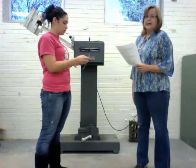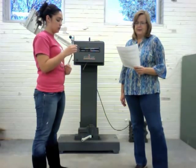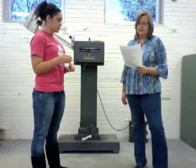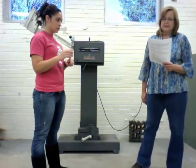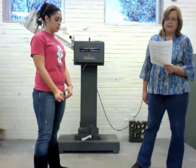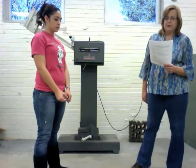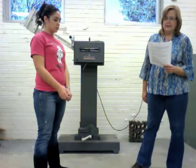The Izod Impact Test is designed to calculate the resistance of failure of a material to a suddenly applied force. These forces are collision, falling object, or instantaneous blow. This is a valuable test to determine the safest material to use in manufacturing and construction. The test measures energy absorbed prior to the fracture. The most common methods are the Charpy test and the Izod test.